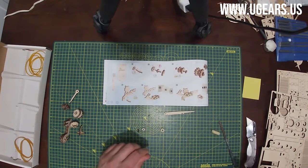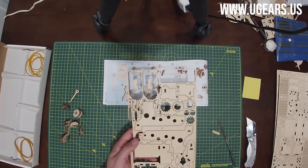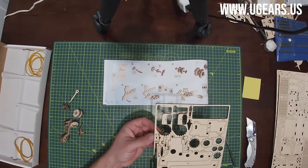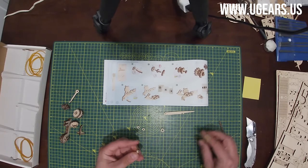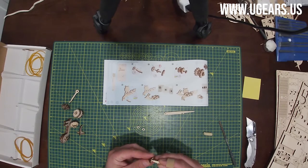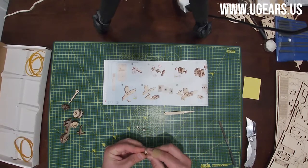All right, so part number 13, where did I see it? It's on the left here, right below part number 3. So we do sanding on the sides. That's just to reduce the friction, and we need gear number 6 inserted from the longer side as far as it can go to the little tabs. And then don't forget to wax the gear itself,